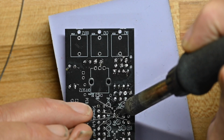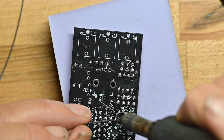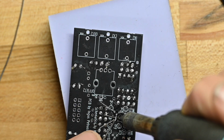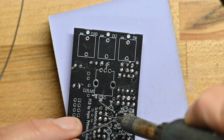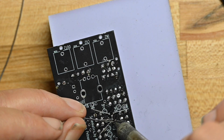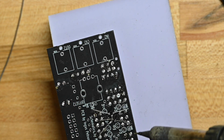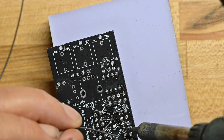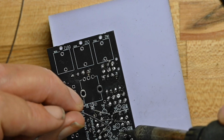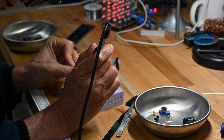And I want to emphasize that part of the reason why I don't need one is because you're not applying any force. Your soldering iron and the solder should not be pressing on the board. They should be touching the leads to conduct heat, but the board shouldn't move because of that. If the board's moving when you're soldering, you're applying too much force.